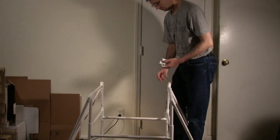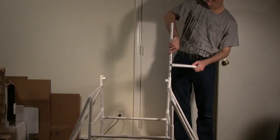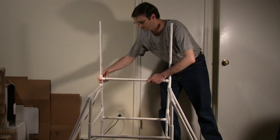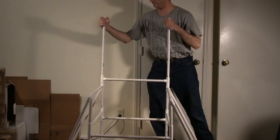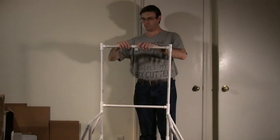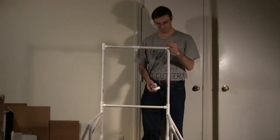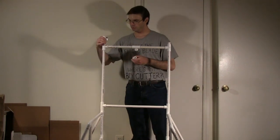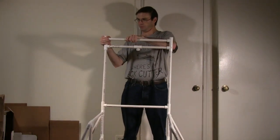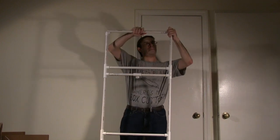Moving to the back rest of the frame: place a 1-inch pipe piece in each of the upward-facing T connectors. Place a T connector in each with the center connection facing inward. Place a 20-inch pipe piece in each of the upward-facing T connectors, then place a 20-inch pipe piece between the two inward-facing T connectors. Place a T connector on each pipe piece with the center connector facing inward. Place a 9-1/4-inch piece in each inward-facing T connector, then place a T connector between the pipe pieces with the center connector facing down. Place a 1-inch pipe piece in each upward-facing T connector, then a T connector with center facing inward on each. Place a 20-inch pipe piece between the two inward-facing T connectors. Place a foot-long pipe piece in each upward-facing T connector, place a right-angle connector on each, and place a 20-inch pipe piece between the two right-angle connectors.